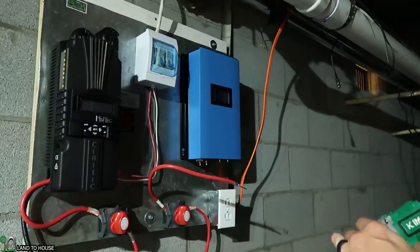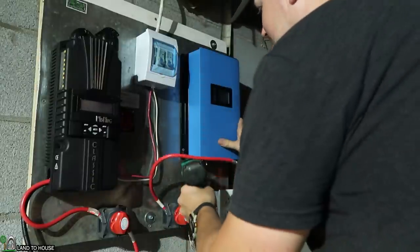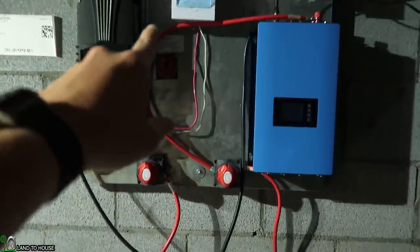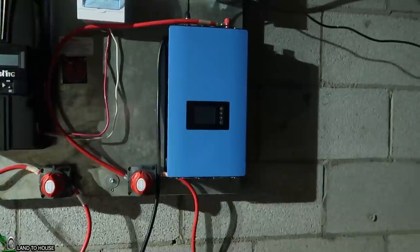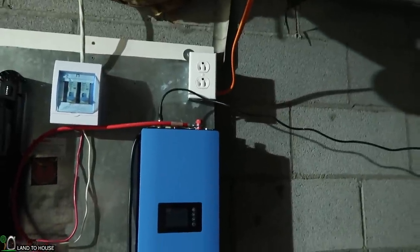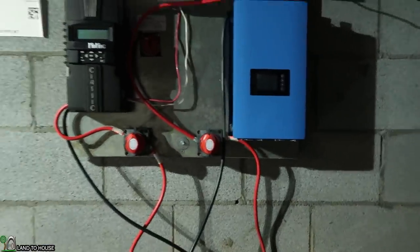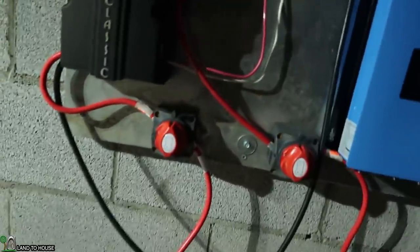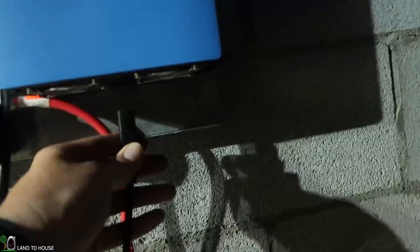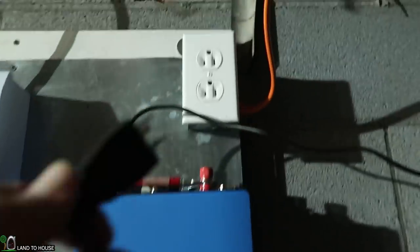I just found a simple but important mistake that I made — the inverter is upside down. So I'm going to take these screws out and get this right side up again. Luckily I had purchased one more long red cable; otherwise I would not have been able to make it. So I just had the inverter upside down, and it is correctly installed now. I had to move the receptacle in order to get this box down low enough to the batteries for that black cable. The last thing for this video is to get the inverter cable connected here — it looks like one of your typical computer cables — and that's just going to be plugged into the receptacle up here.